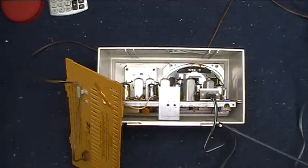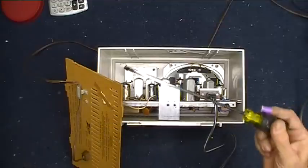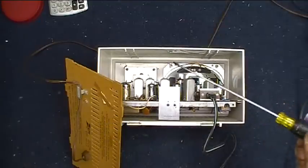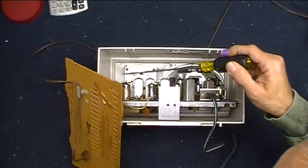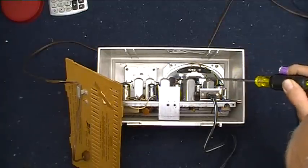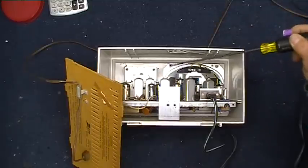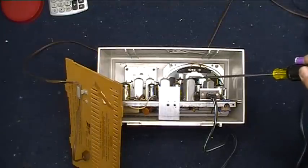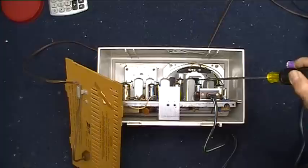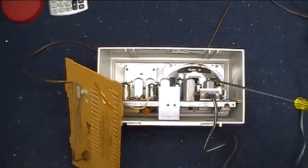Don't be reaching underneath where all of the electronics are and where all of that open wiring is. I've got a screwdriver here — I'm going to hang on to it by the handle, not by the metal. Don't touch the metal. Always keep one hand behind you when you're doing stuff like this — that's a good rule of thumb. I'm just going to tap on the top of every one of these tubes. Very carefully tap the top of the tubes and be really careful where the screwdriver goes. If you've got something insulated to do this with, that's even better. Looks like we might have a bad tube socket.